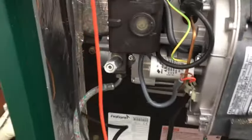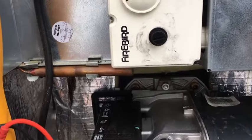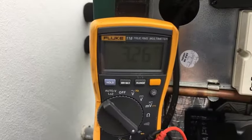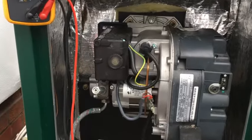The low capacitance might be an indication that either the motor or the pump is starting to have a little bit of extra workload. As you can see there, it's reading 3.26 — it should be 4.5 on the capacitance, so it should be plus or minus 5% on that.